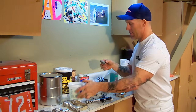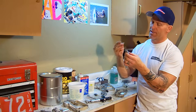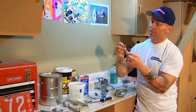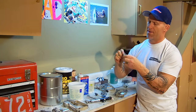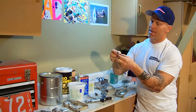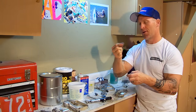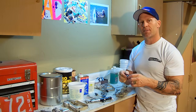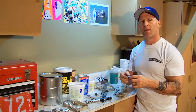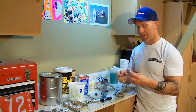We got some parts here. There's an O-ring right here on this part of the packing, and with a little tiny flathead screwdriver, I can pull that O-ring out. If the O-ring's in bad shape, you'll definitely want to replace it, and it'll come with new packings. If you're taking this gun all apart, sometimes if it's several years since you've cleaned it, it's a good idea to just replace the packings and put brand new packings in it. With the new packings come the new O-rings.